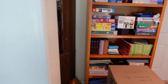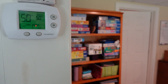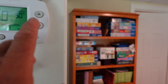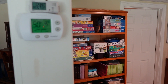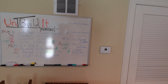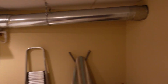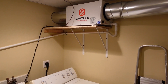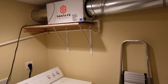One of the other key parts of this is that I've hooked up the Ultra 70 from Santa Fe with their recommended Honeywell Humid Pro remote sensor. The sensor is in the finished space, and I'm going to kick it down a little bit to engage the dehumidifier. You can hear it go on. The dehumidifier is pulling air in through the eight-inch duct from the finished space, through the dehumidifier, and kicks the conditioned — dehumidified and slightly warmed — air into the unfinished basement. Because of the open louvered door, there's no pressure difference, and ultimately that fully conditioned air makes its way back into the finished space.